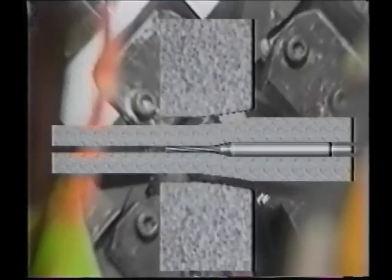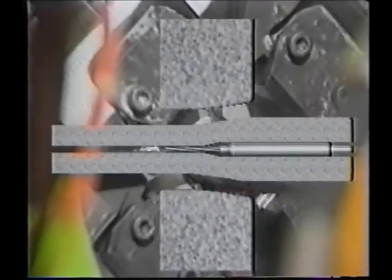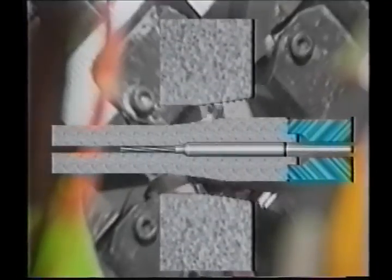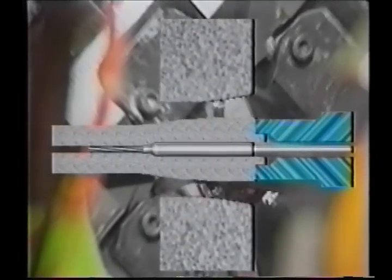Towards the end of the cycle, the mandrel is pushed forward together with the barrel blank in order to forge the chamber portion. The hammers are opened slightly to form an ideal rifling and shoulder transition. At the end of the chamber, the hammers are opened. The main material elongation is taken up by a compensating plunger inside the manipulator to maintain an ideal chamber.